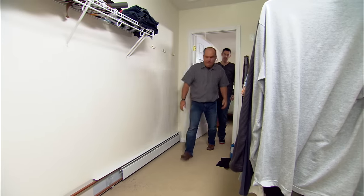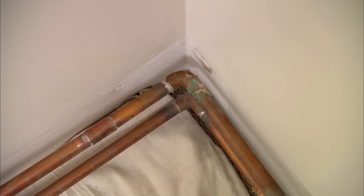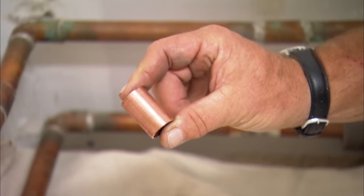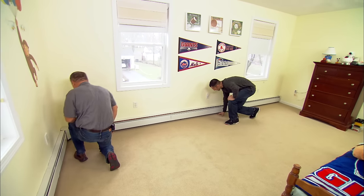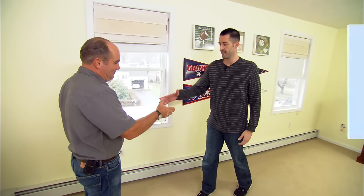Our system is refilling — you can hear the water moving around a little bit. Now you can really see how the return pipe is exactly in line with the supply pipe. It turns out that's the amount the pipe was too long. But now with the cut, there's plenty of room for expansion. Let's get all the covers back on. This zone is back on and this baseboard is piping hot. And what do you hear? Nothing. Exactly as it should be.